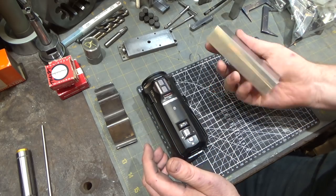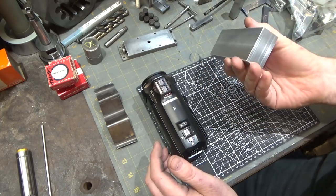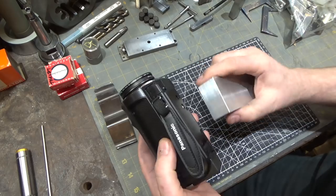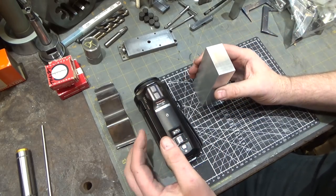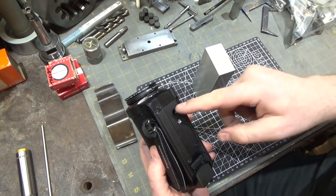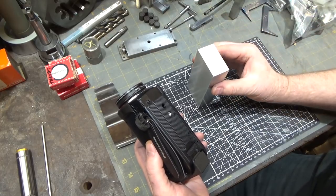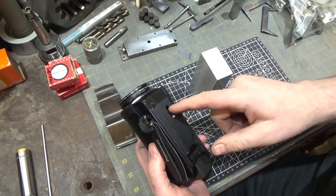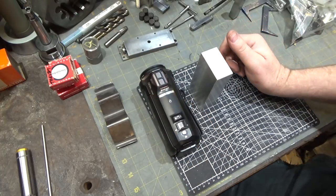I'm going to use this stock that I've dimensioned right here — it's roughly 1 by 2, actually about 1.1 by 2, a little under 2. We're going to make a plate that fits down here. What's going to be interesting is the little nub that goes in there. Originally I was just going to create a threaded part, but this time I'm going to mount it in the four-jaw chuck off-center and turn a round portion that protrudes — just for fun because I thought it'd be interesting.